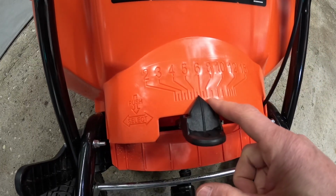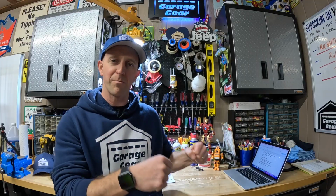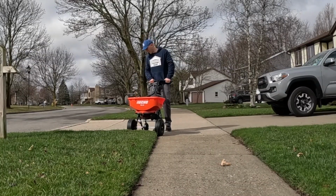Well, some subscribers here on the channel have mentioned the following about this spreader. First off, they mentioned the spreader setting gauge moving while you're using it on your lawn. I purposely hit it on a few hard bumps along the way to see if it would move, and I can safely say that it did not. For my fertilizer, I set it to 5.5 and it stayed there the entire time.